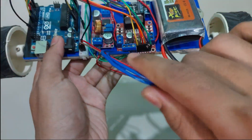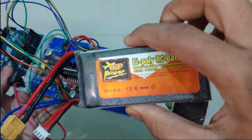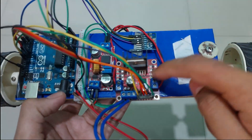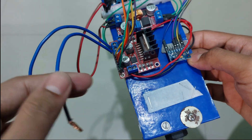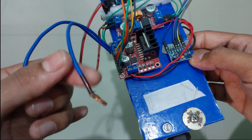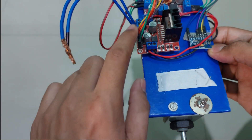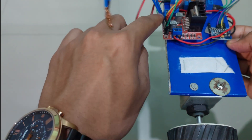For wiring and power: I have a lithium polymer battery — a 12-volt three-cell LiPo battery. I have an L298N motor controller here which takes in 12 volts from the battery. The connector is a little sketchy — the sharpied-on black represents ground and the other is positive — but for most cases it's mostly fine.